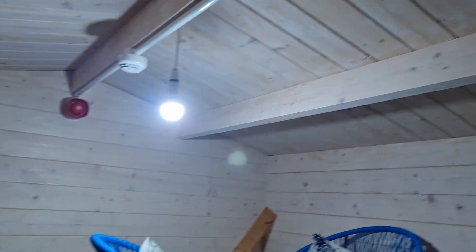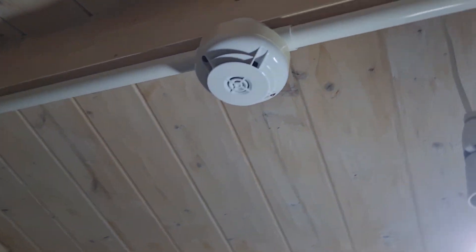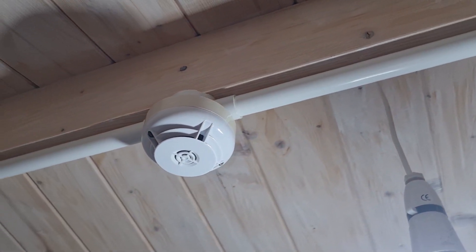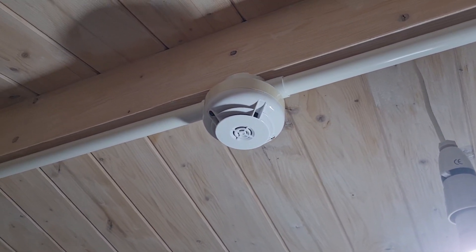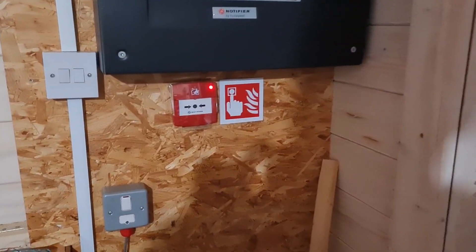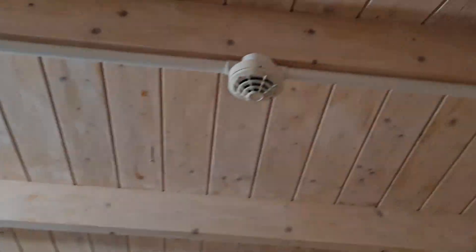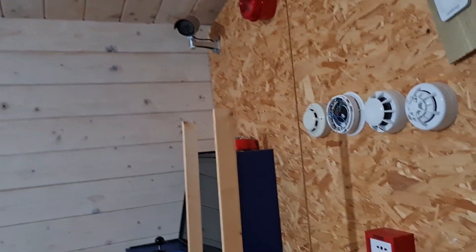I'm going to test the heat detector, I'll test the smoke detector. This is a smoke detector by the way - this is an NFXI optical, one of the newer Notifier Opal ones. It's on an old base, I don't have any of the new bases. I have a new sounder base I was going to put up but I can't be bothered because it means programming the modules. This call point is messed up because I think I took the modules off and it's now glowing red for no reason, so just ignore that - we won't be testing that.